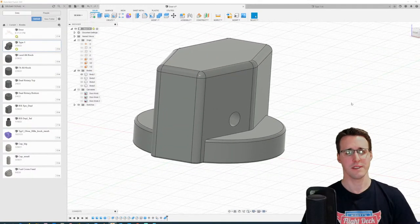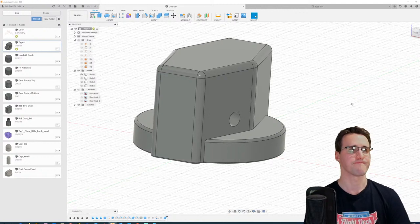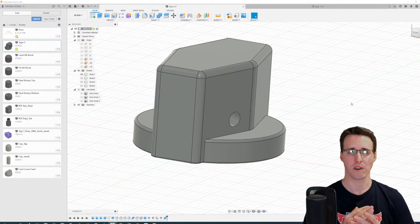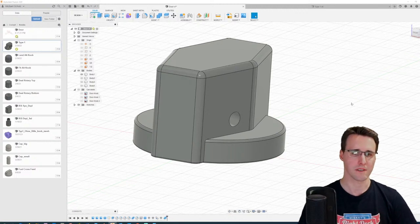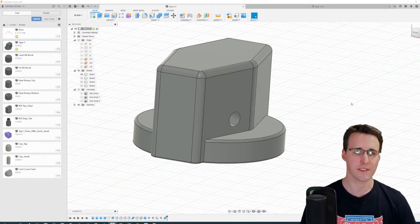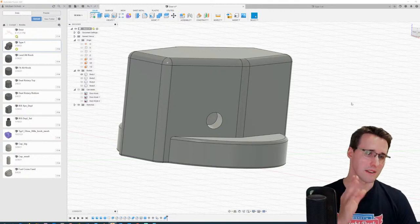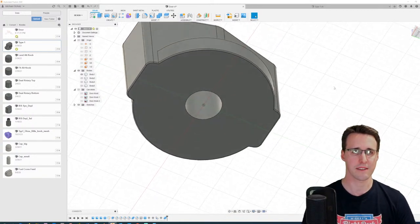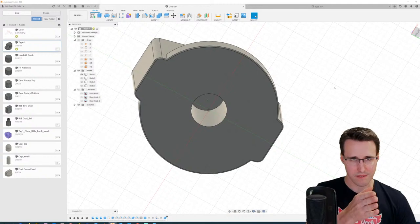Before I modeled my knobs here and resin printed them, I made knobs from resin, but from a mold. I printed only one or a few knobs with my filament printer, and then fine-tuned them, sanded them, and used filler so that it has a really cool and flat surface, and then made silicone molds out of them. And in these molds I drilled the holes by hand, and I remember it was always tricky, first of all, to align this shaft hole here in the middle, and then to drill this side hole here so that it meets the center, or the direction is near the center.